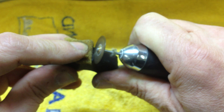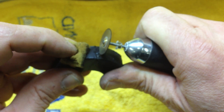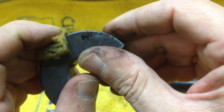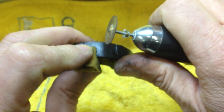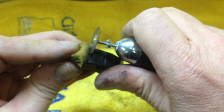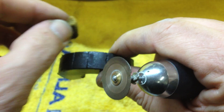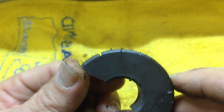You can see there — it's spraying quite a bit of water, which is coming from the sponge. As you can see, it's made quite a deep cut already. That bit in the middle there was just where I stuffed up, but I'll just do another cut to fix it. Also, use light pressure — the more pressure you use, the more susceptible it is to chipping. So if you use just super light pressure and go back and forth, you can see the result.